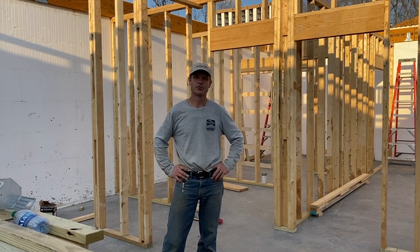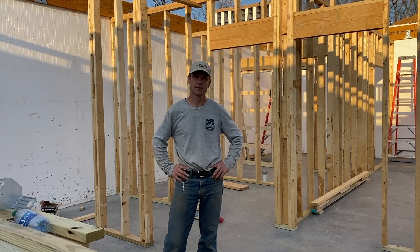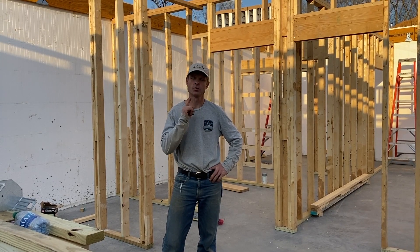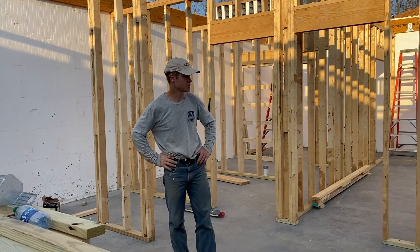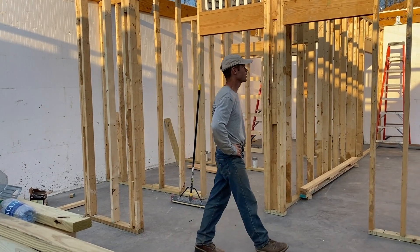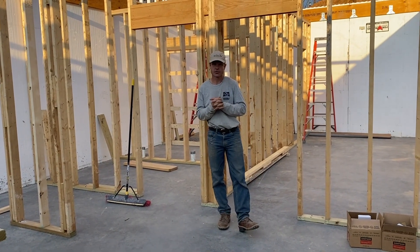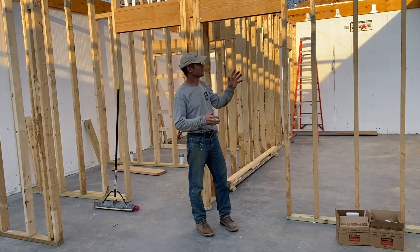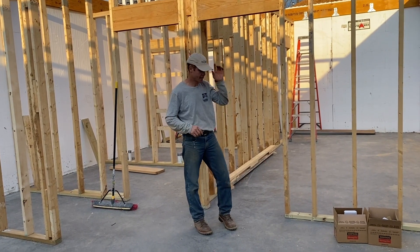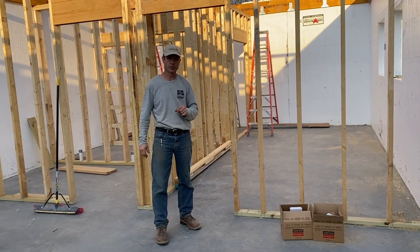The floor is dry — they let it dry for a good four or five days — because all these walls are actually drilled into the floor. This is standard construction stick framing, and these walls down here are actually nine feet. We have a very tall ceiling down here to make it seem a little bit bigger, but stud walls are standard walls that you see in any house, and then they are drilled into the concrete floor with Tapcon screws.